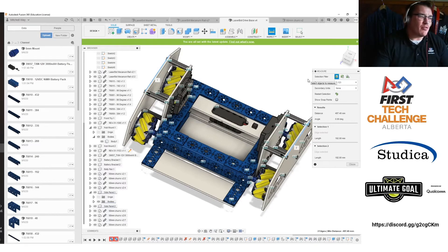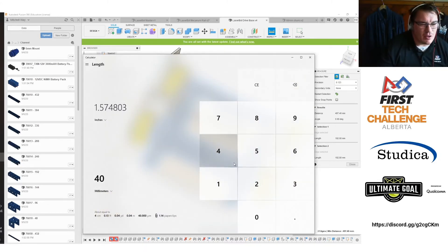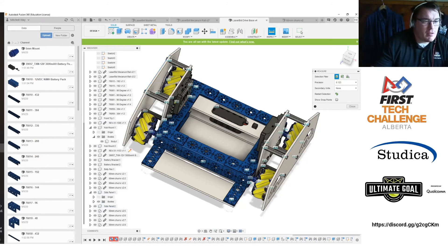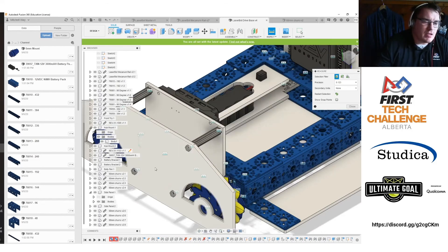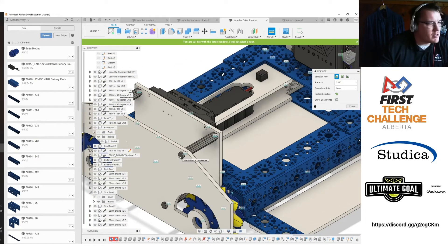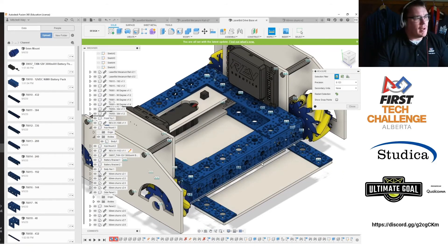This robot is just short of 500 millimeters wide. When we clear it out, it's actually 497 millimeters — about an inch and a half too wide. I need to trim about 40 millimeters off, so I'm going to go do that on my own, shrink it down in a couple of dimensions, and make it more functional. I used a few non-standard cut pieces; you could use your own spacers and probably don't need side pieces. You'll also see these are churros from FRC — relatively easy to get, cut, tap, and throw some quarter-inch bolts into.